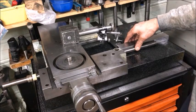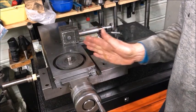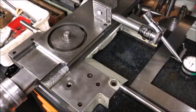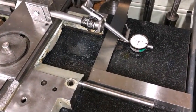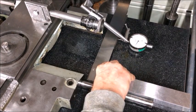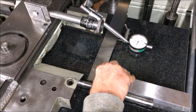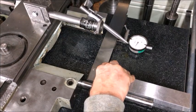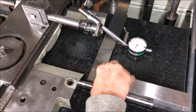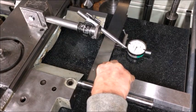This last test is set up to test the facing qualities of the lathe. You should really face a little bit hollow — I can never remember whether this is concave or convex, but I say hollow. This is just a very rough test because we don't have the bed here, so this round cylinder mimics the bed. I hold it steady and square while I rotate the hand wheel and move the slides up and down. I got it to within one to two hundredths of a millimeter and in the right direction — so it faces hollow. Given the worn V-way and this round cylinder, I think this is at least acceptable.